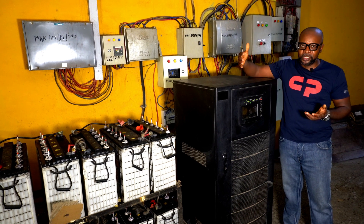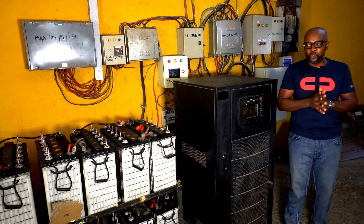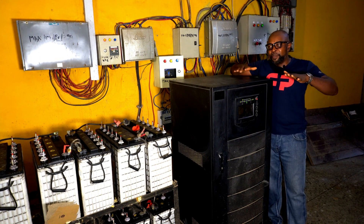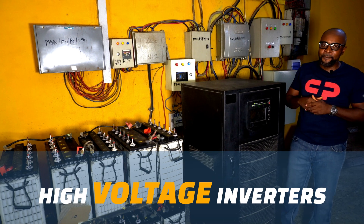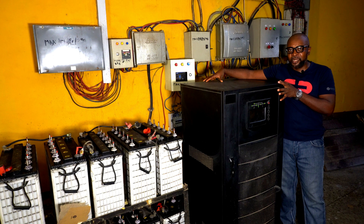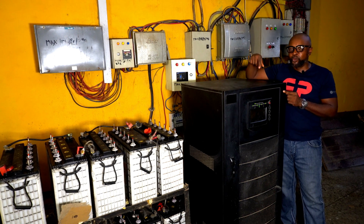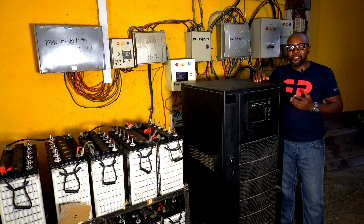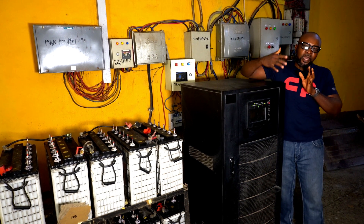It's a lot easier to do the increase without having to buy 32 batteries at once. Another benefit of segmenting your kilowatts into smaller units and paralleling them is that if one unit goes bad, you're not completely stranded — you can use the others and still supply your energy needs while you repair the faulty one. If anything happens to a single large unit, you're completely stranded until it's repaired, which is counterproductive. So you can do three 10-kilowatt units, parallel them to form one 30-kilowatt system, and have a 48-volt battery system that you can expand incrementally.